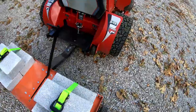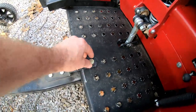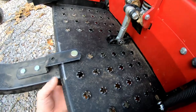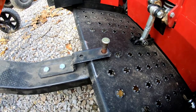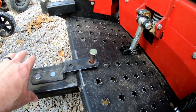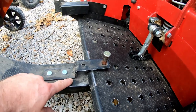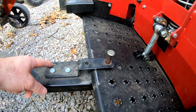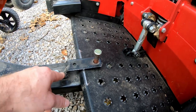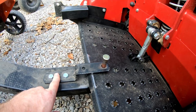I've had some guys ask about the hitch on this. So here's what I have on the hitch. I didn't drill any holes. The platform has these factory holes, so all I have is a half inch hitch pin ran right through the platform. I'm using the factory hitch and everything that came on the aerator — no modifications there. If I do anything, it would probably be adding a little bit of weld on both sides of this, because when you turn all the way and this maxes out and touches the platform, you do have the potential to shear those bolts.